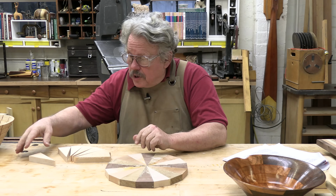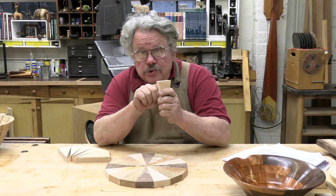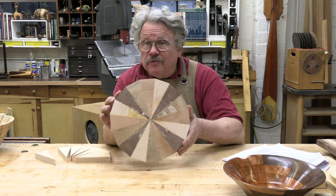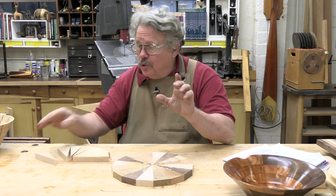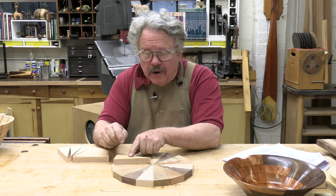The second thing you can do is rearrange the wood grain so that you're cutting mostly long grain. You do this by cutting wedges and then gluing these wedges together to form a multi-sided or circular shape, sort of a wood pie. The wood grain in these pie pieces must be parallel to the outer edges.